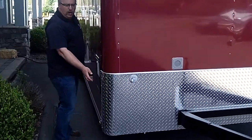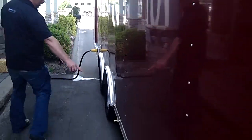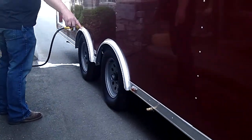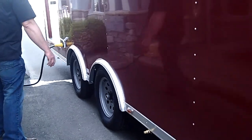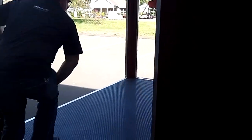City water entry here. Hot water heater here, plumbed for the hot water heater. It's propane fired, so that's your propane stub right there. It's got a 100 amp panel with a 50 amp shore cord, so inside there's a big 100 amp electrical panel so they can run all their equipment on it.